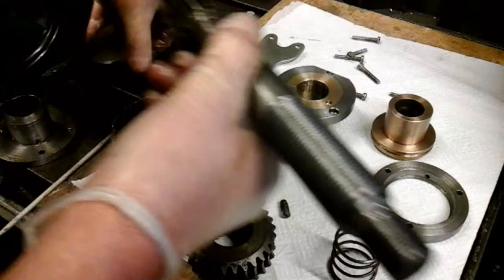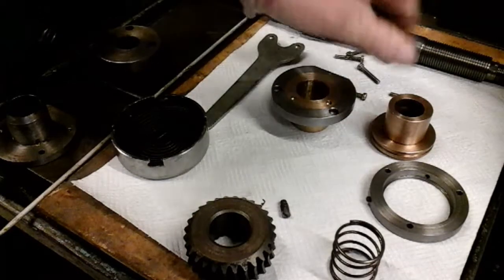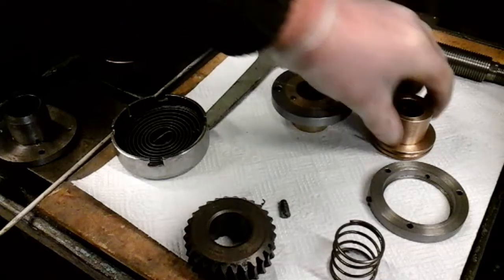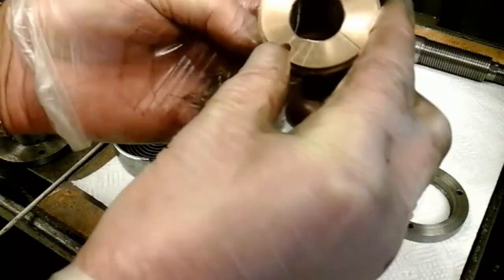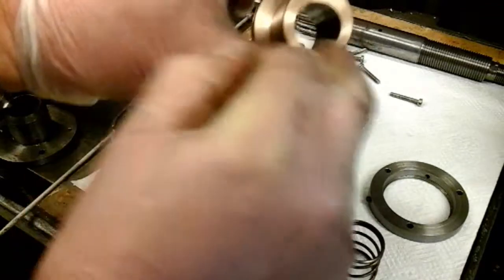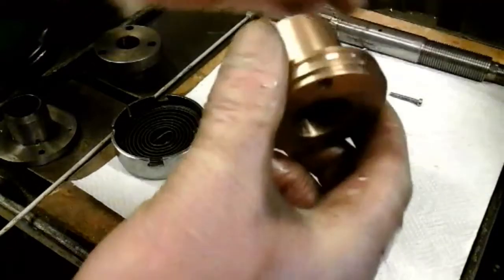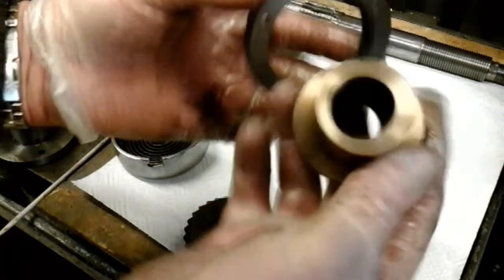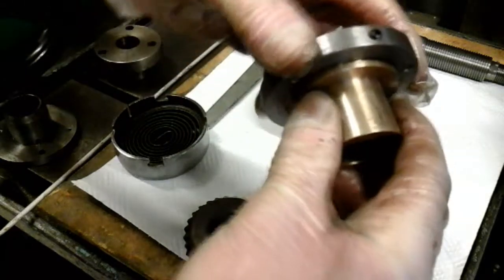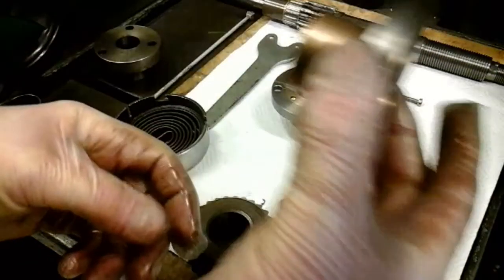You can't adjust them anyway. So what I've done - I took some measurements in my quill and found out I need 100 thou offset. I've designed this now to make it adjustable: I've made this bush with a 100 thou offset, same on both sides, and put a groove in the bush. I've made this steel flange that this bush fits into and traps the bush. That's now going to go into the casting of the milling machine.